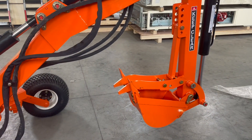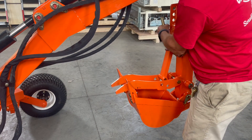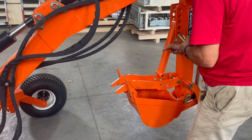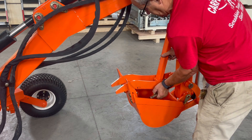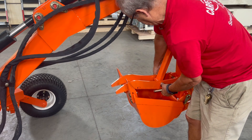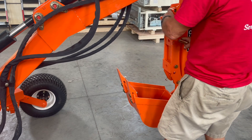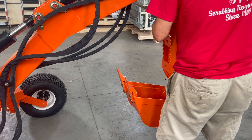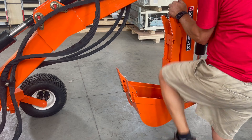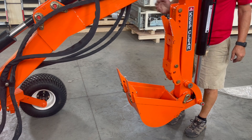Make sure when you're first testing that you have enough hose for when the bucket is all the way back towards the boom. Then you can adjust your mechanical thumb or hydraulic thumb. To move the thumb out of the way, you just put the pin in and lift the thumb up — there are different settings where you can put it out of the way. Put the pin at the very top to keep the thumb out of the way for when you're digging, and move it down for when you want to lift something up.